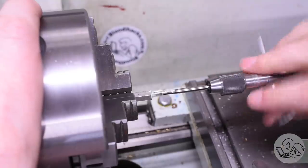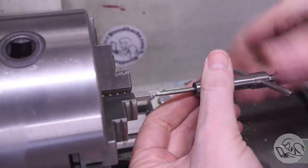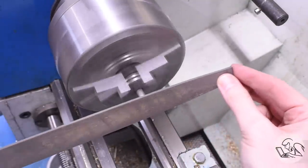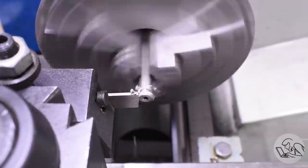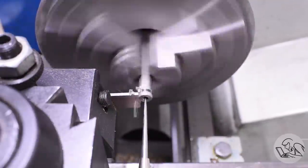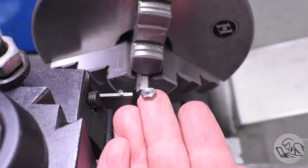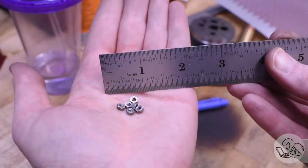I did go on to make my own nuts, and I'll explain why here in a moment. I just drilled and tapped a whole batch of them at a time, and then I parted them off, chamfering the front and back of each one with the file. And when you're between two nuts there, you can chamfer two of them at a time. That is one down and 21 more to go. So here's a batch of six for the studs on the base.